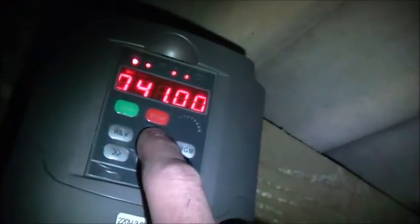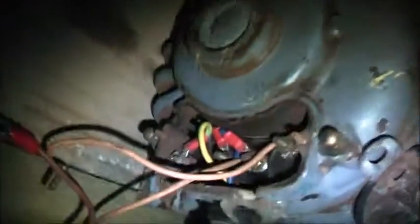I've now unloaded and switched off the run winding - we'll see what happens though. Nah, nothing, right. See, the switch got in my way. As the switch triggers, it won't maintain that speed. We'll bypass that and just put that straight onto the run windings. It should be better. That was pretty cool. Not very efficient, but I've got to ramp it up - I can't just start at a high speed and expect the motor to follow. I've got to start from low, about five hertz, and ramp it up gradually. And it works.